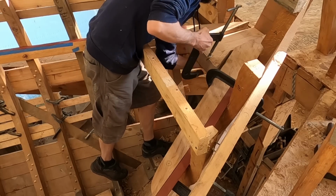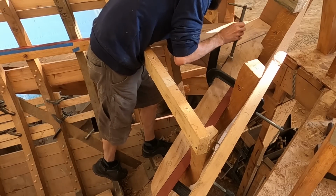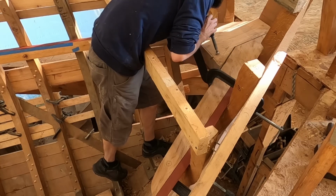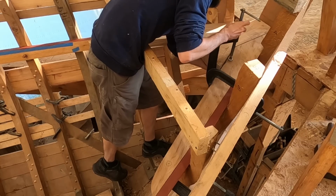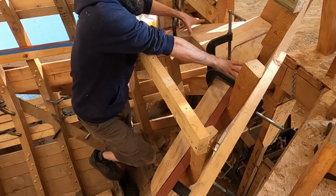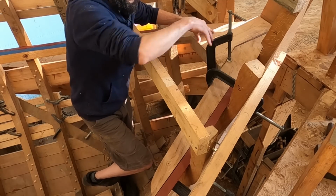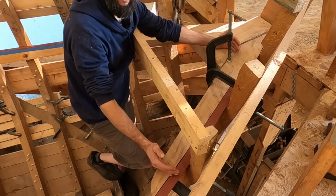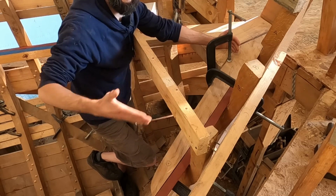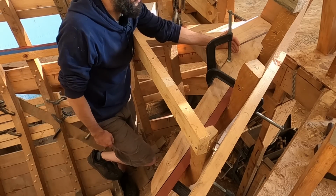So it's got 2 wings on either side that are made out of some live oak that we got donated a while back. And then the center here, this big block, is a big piece of white oak rootstock from when we cut up the knees. This right here would be bigger than what Victoria had. And these wings here, I think, will go a long way towards what Atkin kind of had in mind with extending that strength and rigidity a little farther back into the hull.